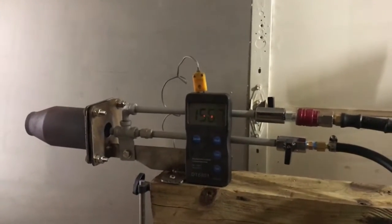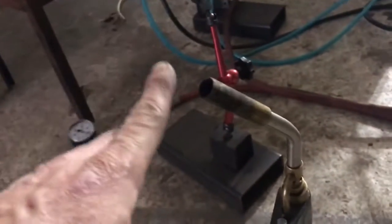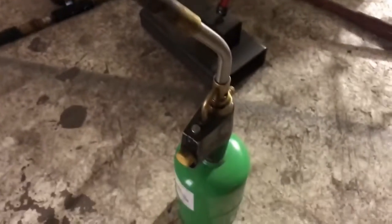It's very hard to get a thermocouple to go above 2200 degrees on any propane torch. So was the performance increased? Definitely — we were able to achieve higher temperatures for sure, almost maxing out the thermocouple, which would have been 2400 degrees. I'm going to have to learn how to light this thing; I still had a little trouble in the beginning. Once you get a small flame inside it, you just have to let it sit and warm up a minute — you can't jump right into adjusting the flames because the combustion chamber itself is helping the ignition process and flame stability. On a good day, if you're holding the thermocouple at just the right spot and your tank is just warm enough, you can get the thermocouple to read 1950 on one of these — but that's it.